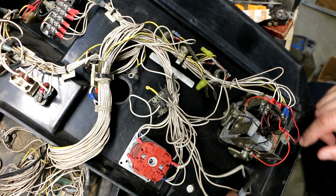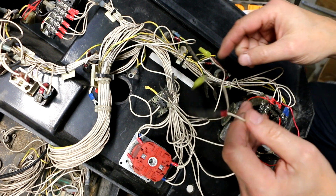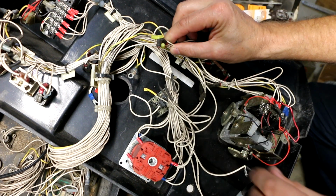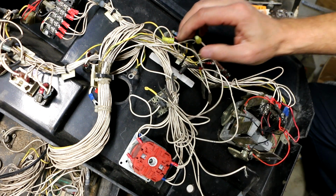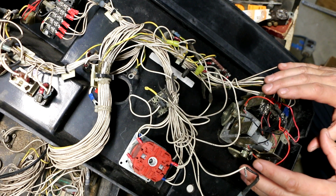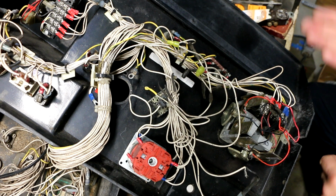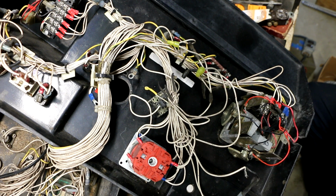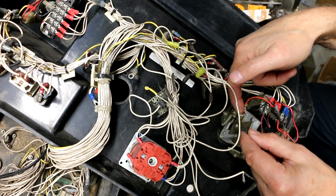So I'm satisfied that I can just fix this wiring to tie these three together, and then these other ones that are either mystery ones or 311, I'm going to tie those off away from this so they can't get impinged by the mechanism here. So that leaves me with just focusing on this unit here. This is the unit that actually is responsible for swing and for lifting and lowering the boom. And I know I've got a problem with that functionality, so maybe it has something to do with the fact that these wires are in really bad shape.